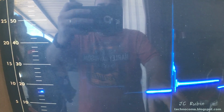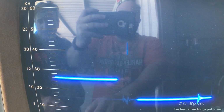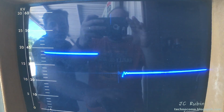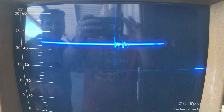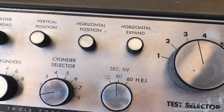And we'll switch back to primary. No, switch back to secondary. And put it so we can see all 4 spark plugs. And we'll bring it back to, it's going to look bad on the camera though, at this RPM range. But this is just a demonstration right now to show that we're starting to get the secondary working on the system. We're going to have to calibrate the ignition for each one of these, 36.